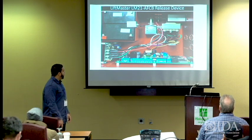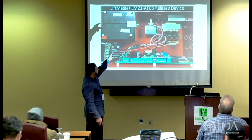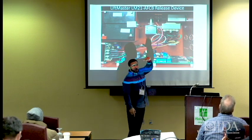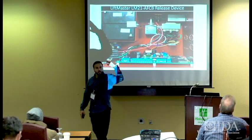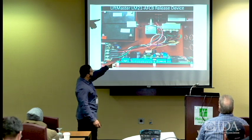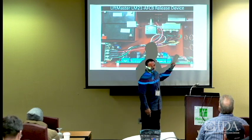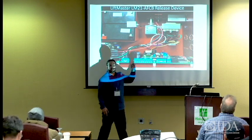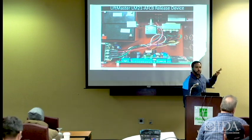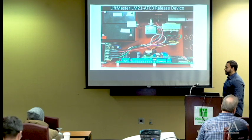All right. So back to this, you have the plunger, you have the transformer. That plunger has on top of it, way up there, that's an actual reset plunger. Sucks in, you can push that to actually reset, and then you have the reset buttons on the side of the unit as well, right here. After a test it may be beeping, you change the batteries out, it's still beeping. Hold the reset button down for 3 seconds, release it. After you release the reset button, it should quieten down and go into normal state of operation, okay?